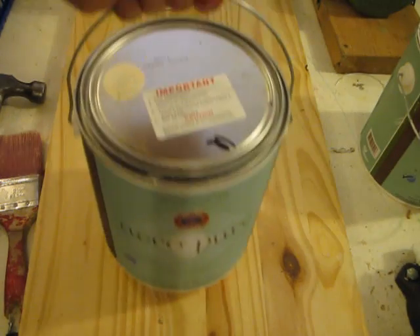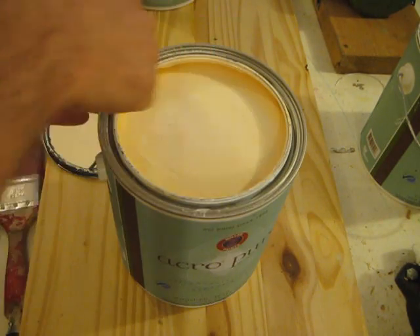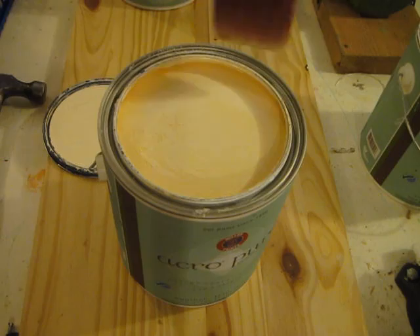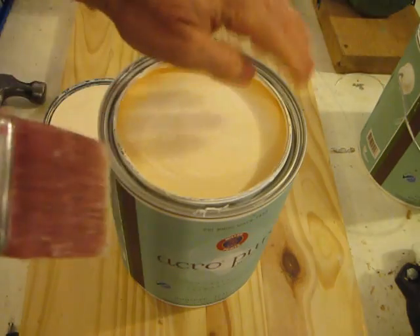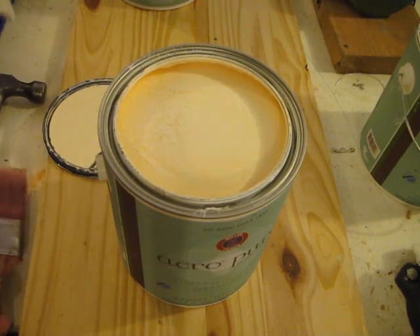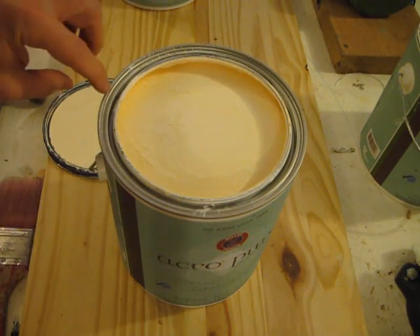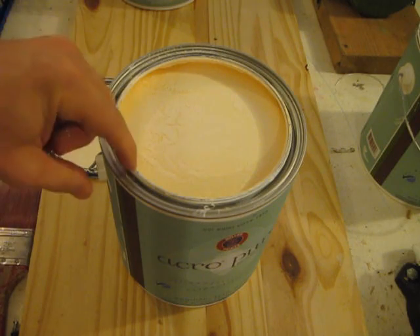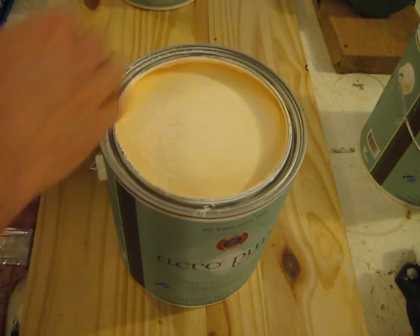So what you want to do — back to our paint can here — paint always gets into this little lip. Take your paint brush and go around right before you close it. You want to scoop up all that paint out and let it puddle. You may want to take a rag on the side because it might drip. Or simply take your rag and go around the rim to get as much of that paint out as possible. If it has gummed up, take a screwdriver and get some of that goop out of there, because you want to get as much out so when you hammer your paint lid shut it will be sealed properly.